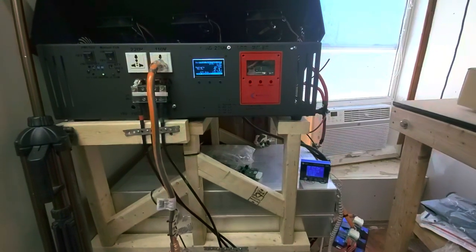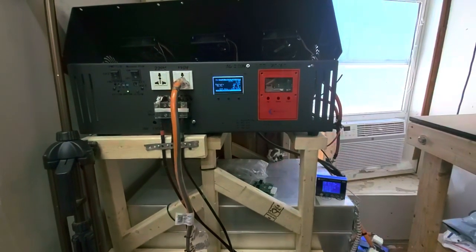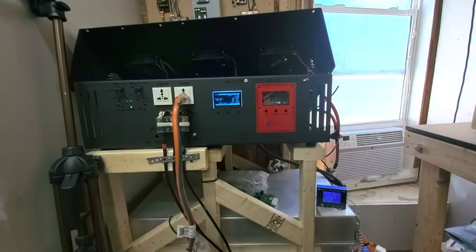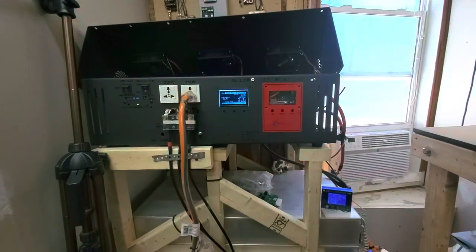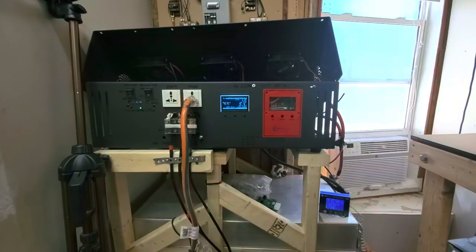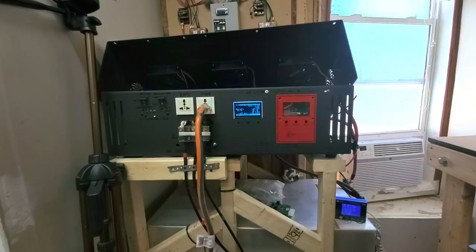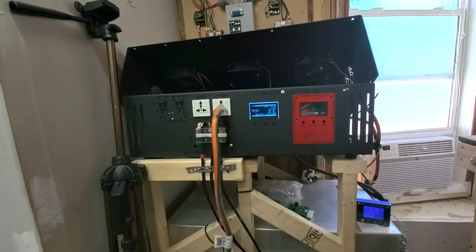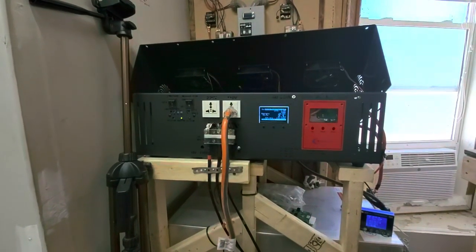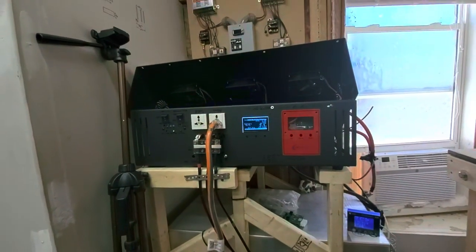This is day number one. I went through basically 24 hours with the system online. I was able to get through the night — there were some things around the house I forgot to turn off, I wasn't really paying attention. I ended up consuming 4.1 kilowatts overnight alone. Add to that the inverter itself, which is horribly inefficient right now, and I was definitely near the 6 kilowatt mark for the night — that's when the charge controllers were in night mode.